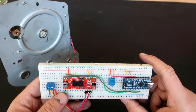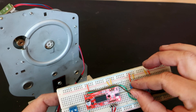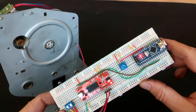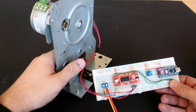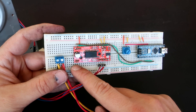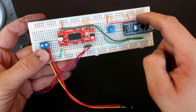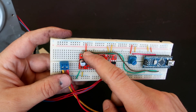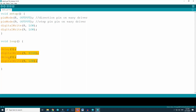And if you want to control it with Arduino you will need this EasyDriver. Don't worry, it is cheap like everything on this channel — it can be found for less than two dollars. So our stepper motor is connected here. Here is power. This is a big motor so 5 volts is not enough — I am powering it with 12 volts. Here are the pins that are connected to Arduino: step pin and direction pin. For each clock pulse on the step pin the motor will rotate one step. And with the direction pin I can control the direction of rotation.